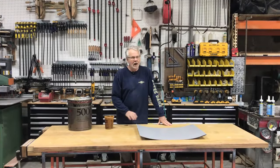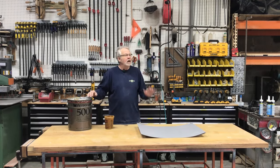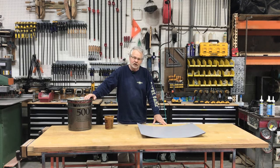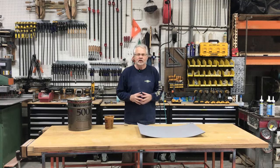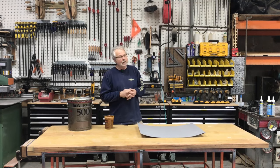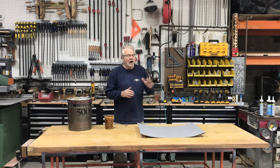I'm getting ready to glue up my doors for this project — I've only got a couple doors to do. If I were doing a big order, I'd take an entire 4x8 sheet, glue it up, then cut my door and drawer heads to the exact size needed. In this case, I oversized the door by going 2 inches bigger each way with the laminate. Then I'll take it back to the saw and cut it down to the actual size. The advantage is I don't have to router and file all my edges clean beforehand — I'll just take care of glue runs and be ready to go into the bander.